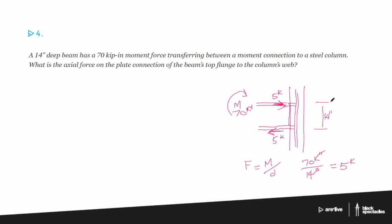There are plenty of other places where 7 comes into play, like when we're trying to calculate, I don't know, a section modulus or something like that. That's where you're getting how far away the material is from the neutral axis. Yep, and that's a key number. It's just that in this case, if this thing is pushing, it's pivoting off a certain point, and if it's pulling, it's pivoting off a certain point. Right. So in this case, we're using the full 14 because that's the whole rotation that's happening.